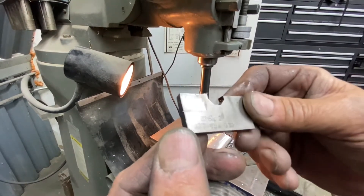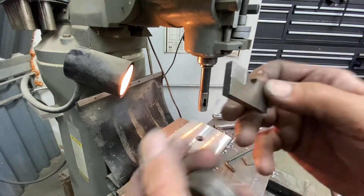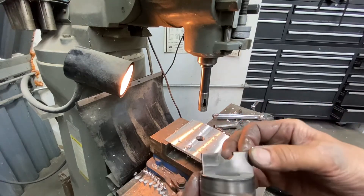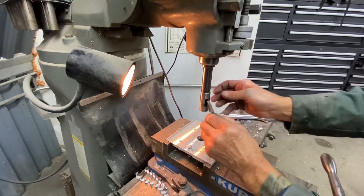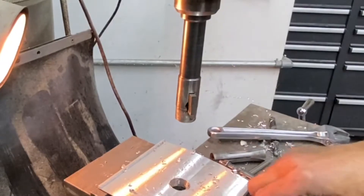So I have my one-inch hole through. Now I'm going to jump up to a two-inch. This is the blade for a two-inch hole, and that would be the pilot that we'll use when we go to the three-and-a-half-inch hole next. First of all, I'm going to put the blade in, and there's a set screw in the bottom that you tighten down and it self-centers itself.